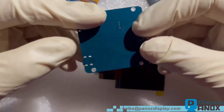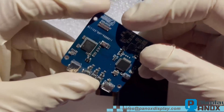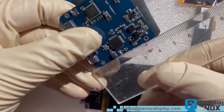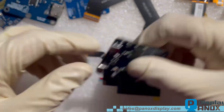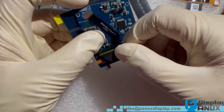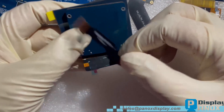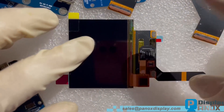There is a custom HDMI controller board we made for a client. The size is only 45mm by 45mm. The board is smaller than the display, so it is perfect for developers to assemble products. According to our experience, many clients need a board smaller than the display screen so they can put the board on the back of the screen and connect it to a Raspberry Pi or other single-chip board. Bezel-less is also important in some products. The resolution of the OLED is 800 by 600.